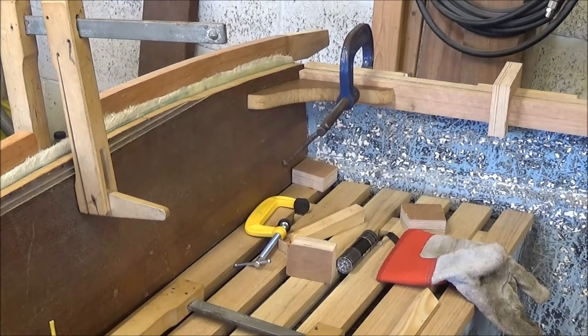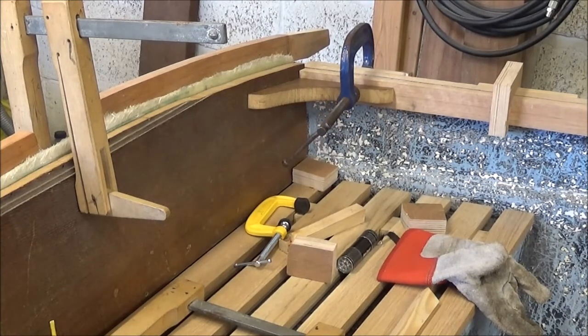It's possible they may have been slightly better if they'd been slightly thicker. But bear in mind that what was on there was just a piece of plywood on each one plonked on the top, and I don't think there was any remains of any other former knee in that area at all, so I think they're going to be good enough. They'll screw into the rails, or the rails will screw through into them, or nail through, and some screws. Again, there won't be any glue involved, possibly a bit of sealer on the faces, but it'll all tie the boat together, which is its aim anyway.